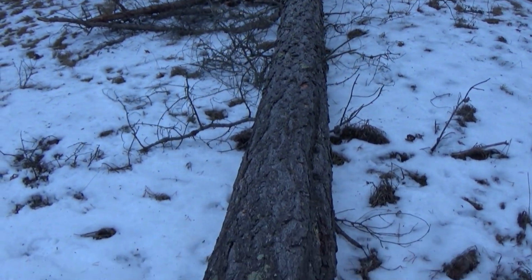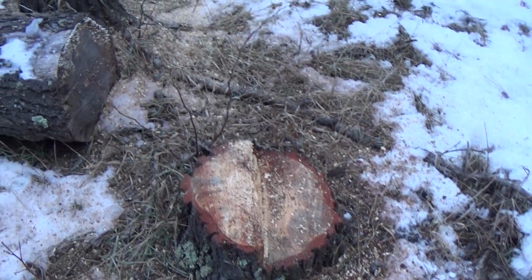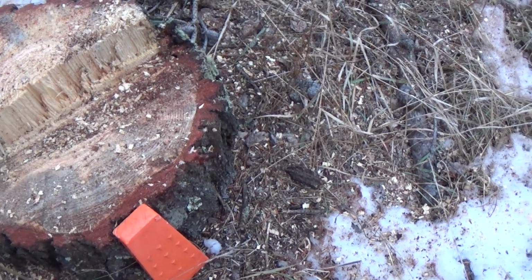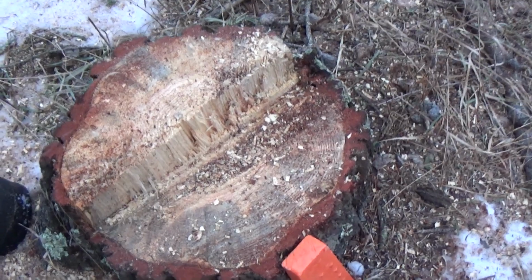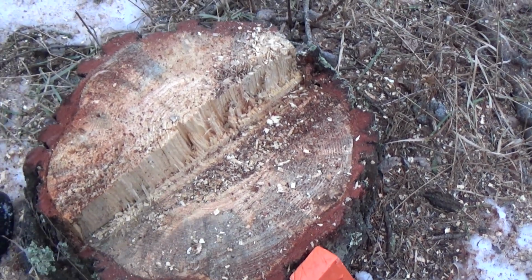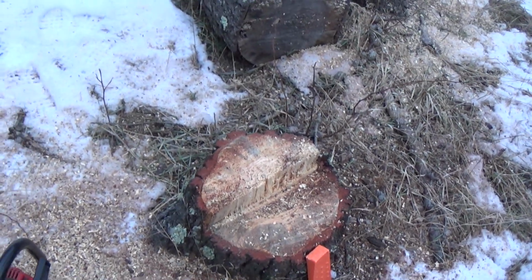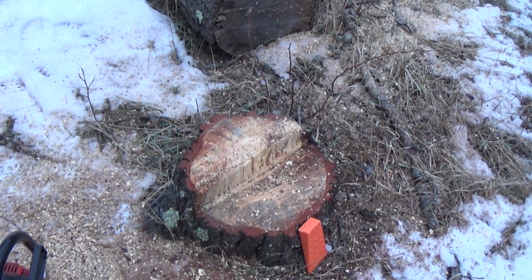This is just a firewood operation here today, but just to give you an idea of overall, like I say, I got a couple of these little 5-inch wedges, and you can see that stump is literally just at the 4.5–5 inch mark. There's a little bit of like a 2-inch riser over here on the back side of it, and a lot of times what I do is I will come back in and retrim that off if I'm working in an area with a machine, because if you're going around corners with a skidder or something like that, you don't want to be bouncing up over big high stumps.